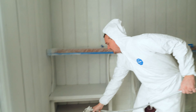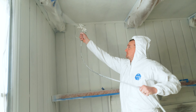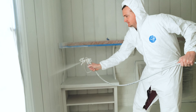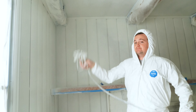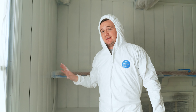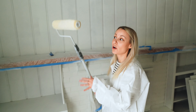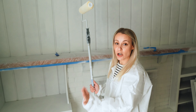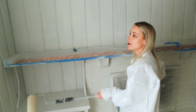So check it out — it puts a nice smooth coat on and you don't get any drips that way. Just to be safe though, Sarah's going to go behind me and do some back rolling. For back rolling it's super easy — just go look for drips anywhere that Jamie has already painted and go over it with a dry roller. There's no paint on it; it just helps get out any excess dripping that might happen as it dries from places where there's a lot of paint.